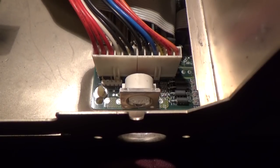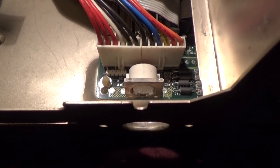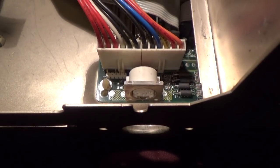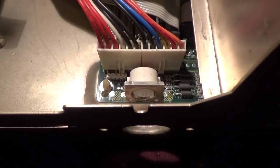You may have noticed that these ECS boards do have a PS2 header. I'm not using it and I don't know the pinout, but we could quite easily reverse engineer it because there are vias for a PS2 mouse port, so we could just bell it out with a continuity tester, but my mice are mostly serial, so I've got no incentive to connect it.